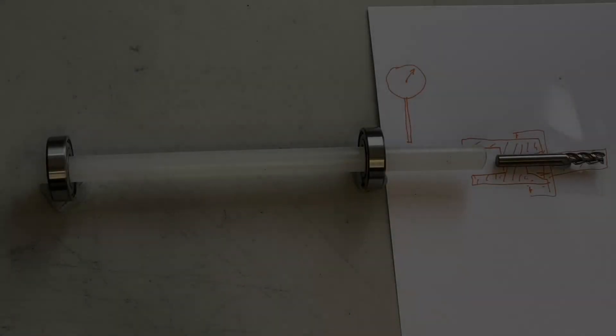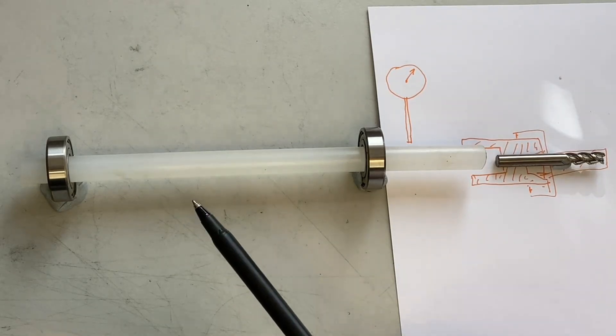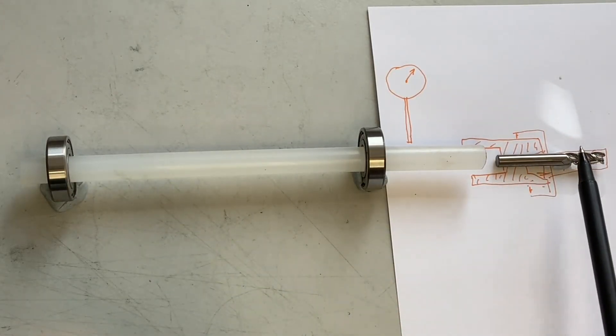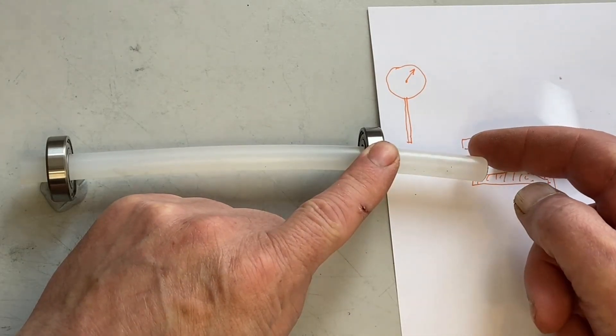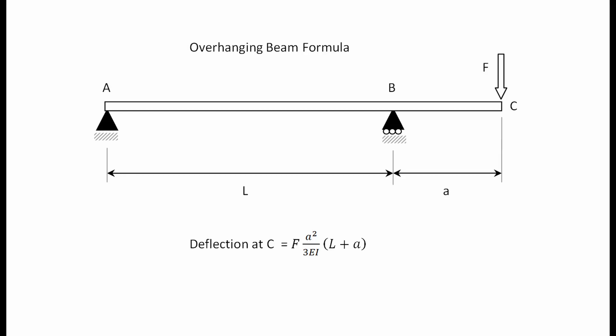So am I happy with this mod? Not really, and I'll show you why. What I've got here is a mock-up of the spindle — the spindle shaft down the middle, the two bearings, imagine a collet chuck here and then the tool in the collet. I've been measuring the stiffness right up here by the spindle nose. What's happening is that when I apply force to the spindle, you can see the whole shaft is flexing between the bearings. If you work the maths out for an overhung beam, the stiffness you get for a 10mm diameter steel shaft, 130mm support spacing, measuring displacement in this area, is of the order of about 6N per micron.